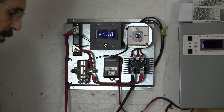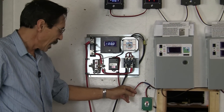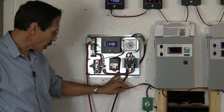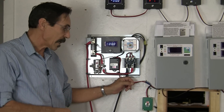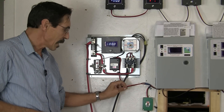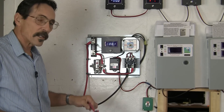It's all pre-wired and here are the heavy cables. These will connect to your battery bank. This small black and red wire is the sense wire for the charge controller. This gets hooked up to your battery bank first before any wind or solar is connected or turned on — always remember that. The small sense wire gets hooked up first along with the battery leads.